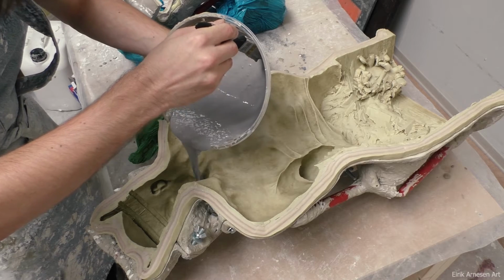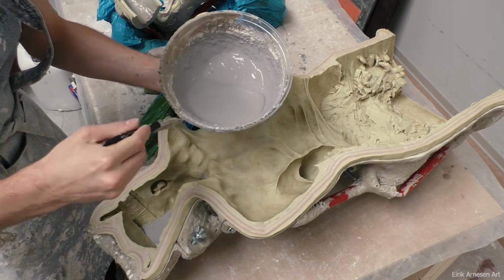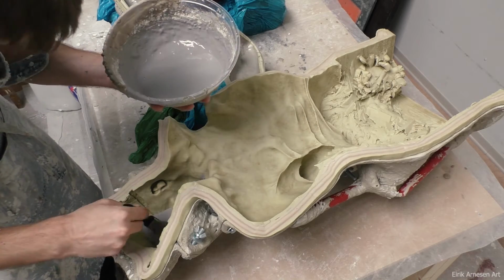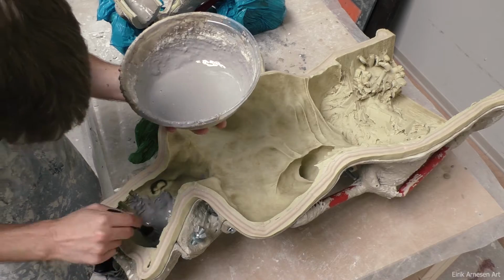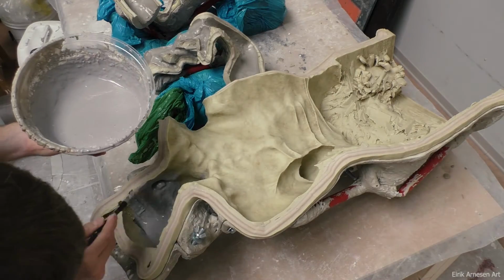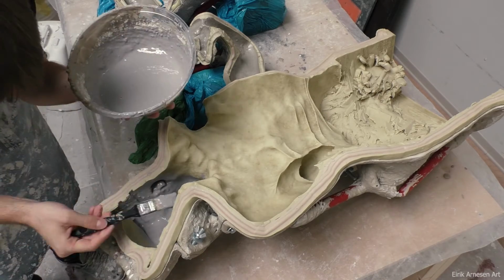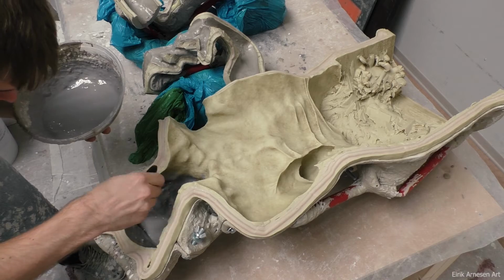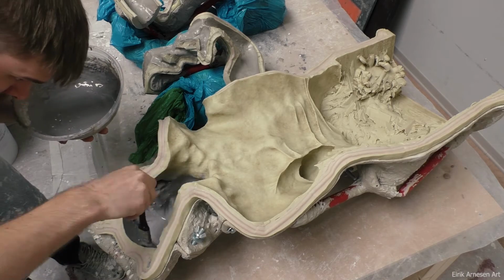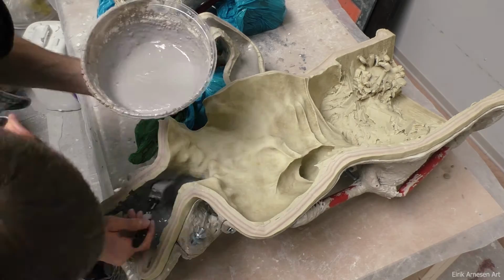So as you can see, my mold is kind of shaped like a half pipe or a bowl, and up against the sides of the bowl I don't want my resin to be running down and me having to chase it to make sure that I get an even thickness. This thickness to the resin also means that it sets up or hardens in a decent amount of time. The amount of powder added will affect the setting time. More powder means that the resin will harden faster.